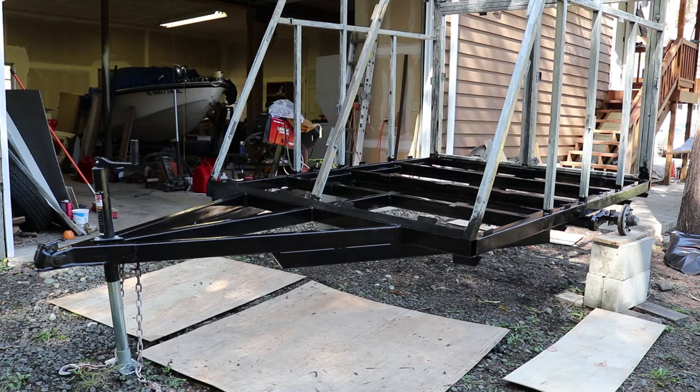A little goes a long way — brush it really thin and even, to the point where you see some streaks of metal underneath. What will happen is after the leveling agent starts to work, it will smooth right out and cover very nicely. It took me just a little less than half a quart to do the entire bottom frame of the trailer, both underneath and on top of the base of the frame.